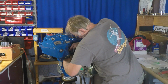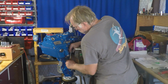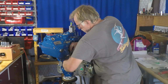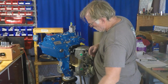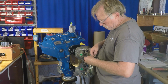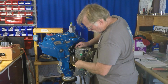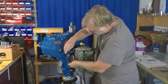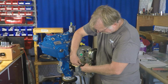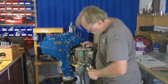If not, then you're going to cause someone else a lot of maintenance hassle having to disassemble parts of the engine so they can come back to these little tubes just to give them a little tweak or to replace them. Even if you have to replace them out in the field, you're not going to make anyone's life pleasant. So that's what we're doing here, is we're just making sure that the tubes are, most importantly, the correct tubes. With the positioning of the engine and the geometry of the engine, these tubes are different. The intake tubes are different. So you just got to make sure you have the correct one on the correct cylinder. Check the parts manual, and of course check the fitment as you're assembling the engine.